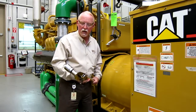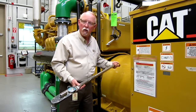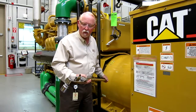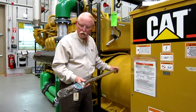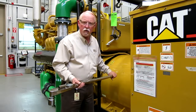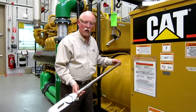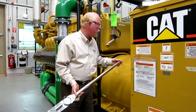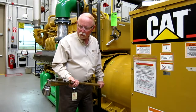This one happens to be a three-quarter drive. As you can see, we've got the big old cheater handle on here, although we never want to cheat — never go above what the wrench can do. This happens to be a 9SAM7351 in our catalog, and it is three-quarter inch drive. This one goes about 800 Newton meters, or it'll also read foot-pounds up to 600. This is good probably between about half to two percent accuracy, so you're pretty doggone accurate.